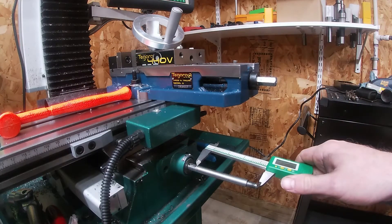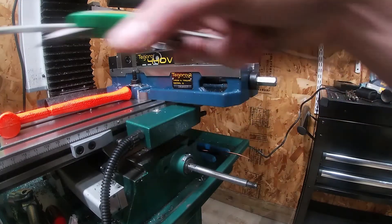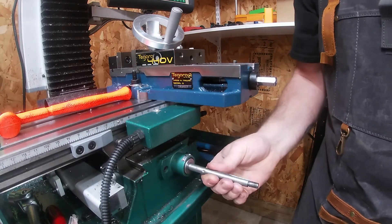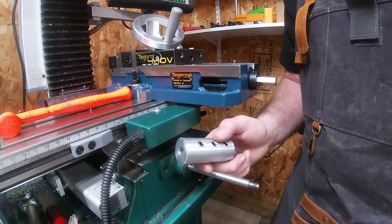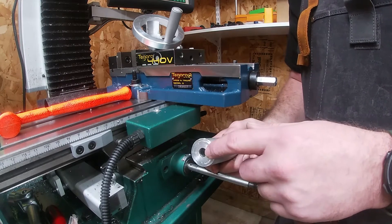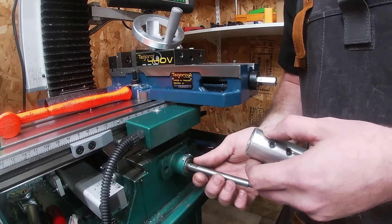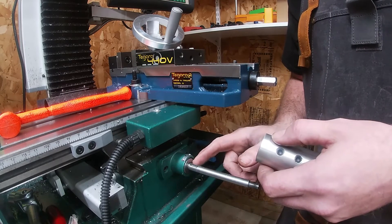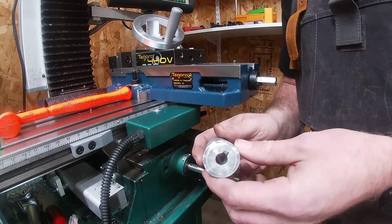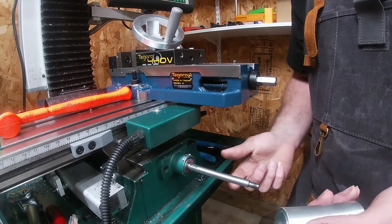I'm going to get you some measurements. With the approximators, I went just a little bit less than three and a half inches. I went ahead and used all the same keys. Here is my aluminum spacer — all I did was match the geometry of the handle itself. All of the force is transmitted through the thrust washer — the thrust bearing — so there's just a little bit of space so it's not constantly rubbing on the cast iron. I got myself a very ugly keyway cut by hand, but perfectly functional. Drop the key in, slam it all together, tighten it up, and I got all of my travel back.